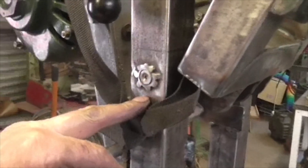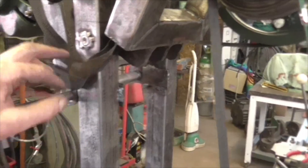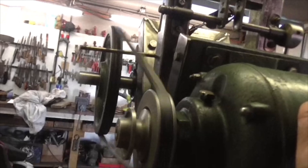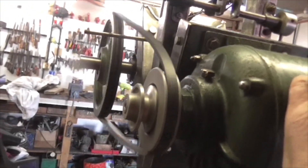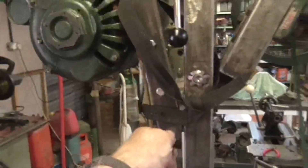It's a 15mm hole and I've got a 15mm pin but the pin won't go in. So I've cleaned up the 15mm pin, lightly emery taped it, and then worked on the inside of the holes with the Bodger's Reamer. I've now got the pin to fit beautifully and it's taken all that play out. The result is it's much much quieter. That frame isn't rattling anymore and it's running really nicely.